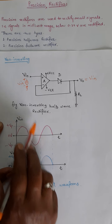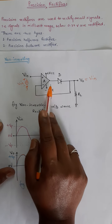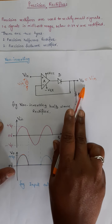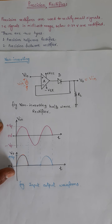During the negative half cycle, the voltage at the output of the op-amp is negative, making the diode reverse biased. This opens the feedback path, so the op-amp goes to negative saturation and the output voltage available is 0 — there is no output across the load resistor. The op-amp switches into conduction when the diode is forward biased and goes into saturation when the diode is reverse biased. For this purpose we require a very fast switching operational amplifier that can switch from the saturation level into the conduction level.